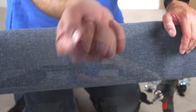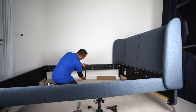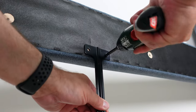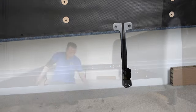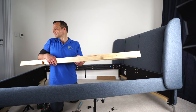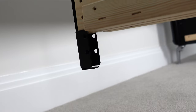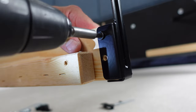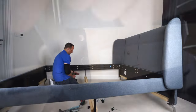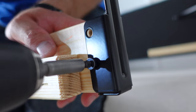Now we're going to need those screws and brackets — they're coming in the middle, attached right here. Secure them on one side and on the other. Exactly the same on the other bracket, secure with two screws. Now this wooden panel — position it exactly the same as I have it. Slide it on one side and on the other side between those brackets. Four screws — one from one side securing the wood into the bracket, another screw on the other side at the bottom. Exactly the same on the other side: one screw on top through the bracket to the wood, another at the bottom.